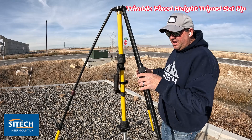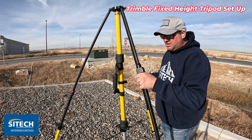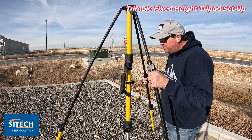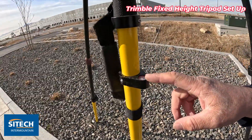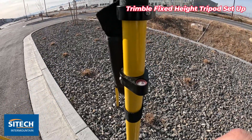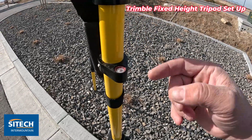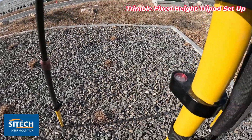Don't lose your mind over the bubble at this point because you're still going to hang stuff on it and it may get it out of level. Just kind of get it close. What I've learned over the years is these little clamps — the ones you squeeze to make it slide up and down — can get sticky. Squeeze them with both hands and spin it while watching the bubble. Remember to leave the back side loose. Now go ahead and level it up. Once leveled, just spin the whole bar 180 degrees and look at the bubble again to see where it's at.